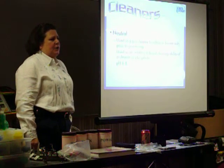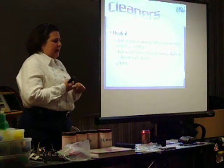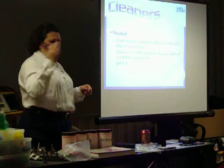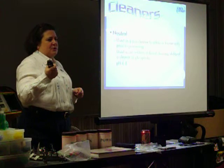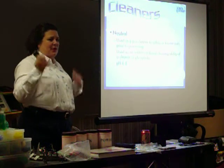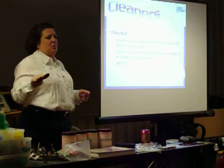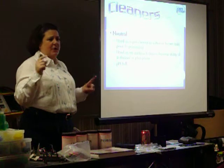With neutral cleaners, primarily what you've got is an additive package. If I'm having trouble cleaning with an alkaline cleaner, primarily in an immersion tank, I may want to put in a little bit of a cleaner boost because I've gotten a job that comes in once a year. Do I really want to set up my whole system for something I do once a year? No. I want to set up the system for 95% of what goes down that line. If you've got something that comes in once a year, we'll adjust for that when it comes in.